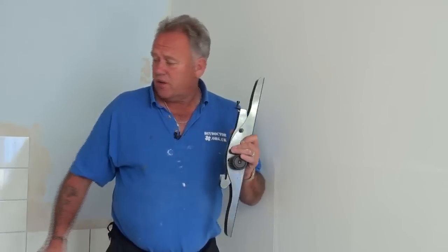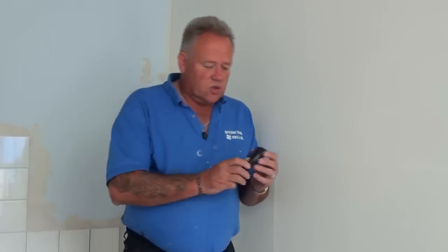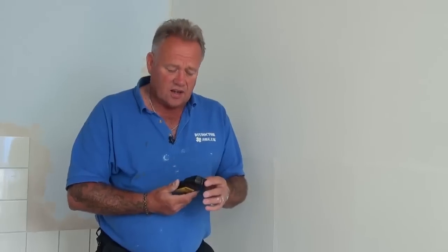So we are going to show you how to use something like — let me put this down a moment — how to use a stud detector, an electrical stud detector. This particular one is called an Intelli Sensor. It is very sensitive indeed and not only does it tell you where the stud is, but it gives you the edges of the stud — it differentiates between the void that is behind the plasterboard and the very edge of the stud.